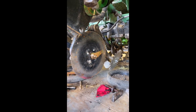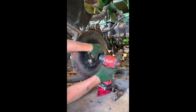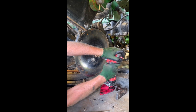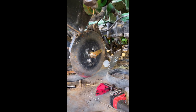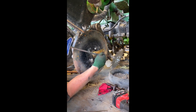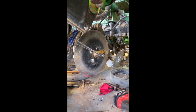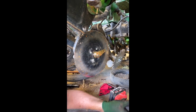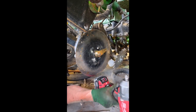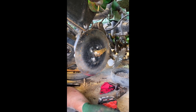This smaller nut torques to 120. For those of you that like to use your Milwaukee half-inch drive, I was set on number two, which got us really close to our desired torque of 100 to 120.